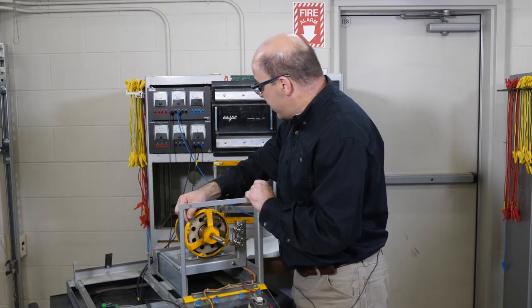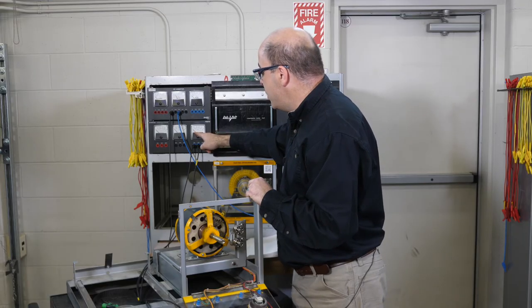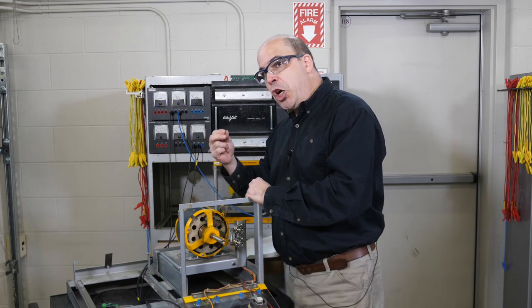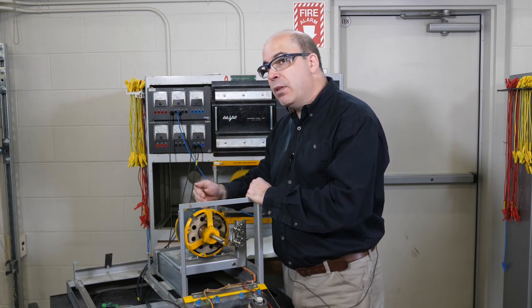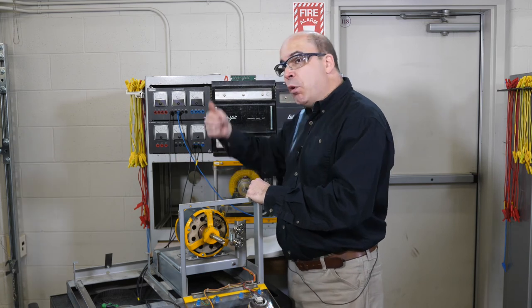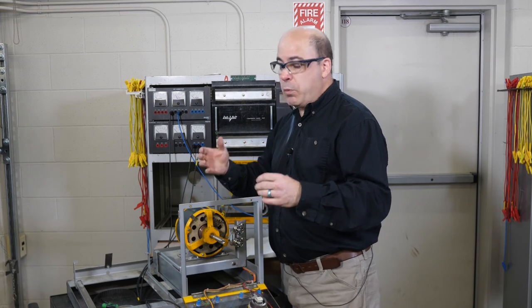So I'm going to return the yoke and try to find that zero value or close to it. I've got the minimal amount of voltage at the brushes and I've seen that the current increased. This may seem counterintuitive, but when we see arcing and sparking at the brushes it's because the brushes are not properly placed on the armature — it's due to an excess of voltage. We want to see optimum current flow. By not placing the brushes properly, current flow goes down, voltage goes up, and that restricts the speed of the machine or its ability to produce voltage. Under the right circumstances this machine could be a motor, or we can wire it up to make it an alternator or a generator for DC power.